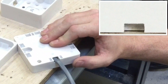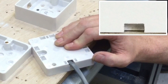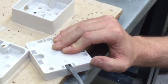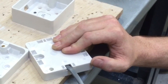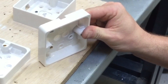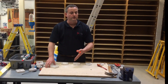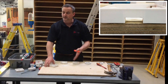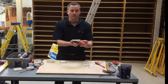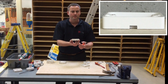The IP rating on the top of this enclosure will not be IP4X as it stands, so it will still be accessible for objects greater than 1mm. We're going to end up putting silicon sealant in here to return the IP rating to its correct value — we'll do that later. The box is now ready to be secured to our wooden surface. We're going to replace the box with the oversized hole, which we know will be well off IP4X, and replace it with the one I've just cut, which better facilitates the cable.